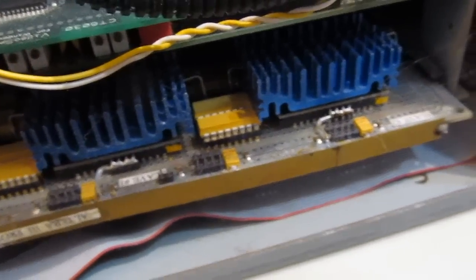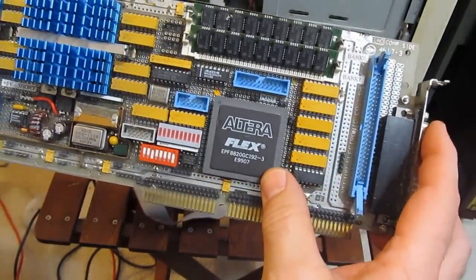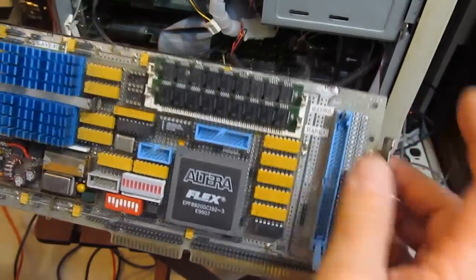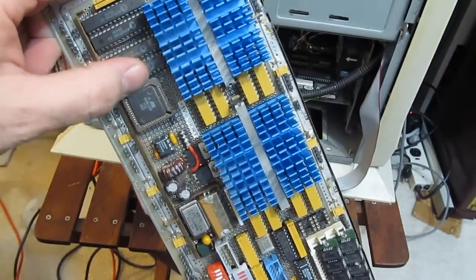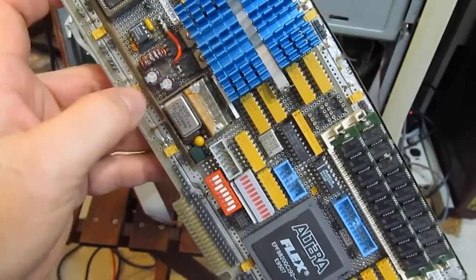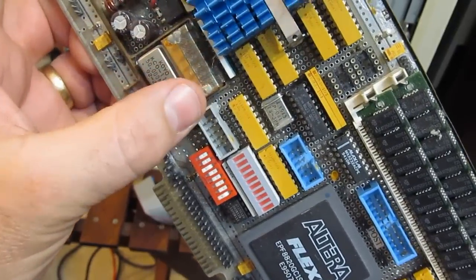This is the board down here that I want to show. I'll go ahead and pull it out. There are three FPGAs on the board — two located under here and then the large one here. There's some DRAM, some flash memory, and some static RAM. Here we can see the power supply, the main oscillator running at 50 megahertz, and this is the clock multiplier and distribution chip.